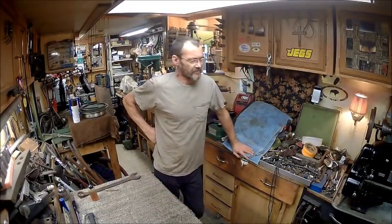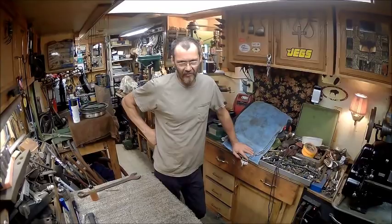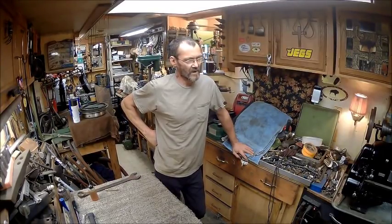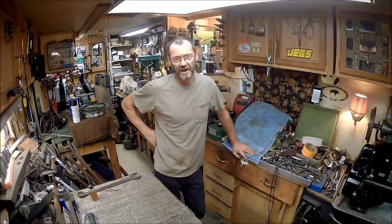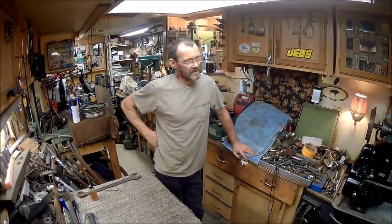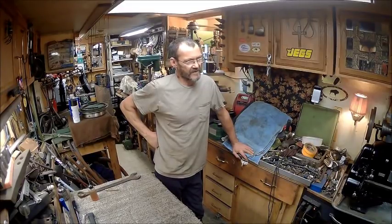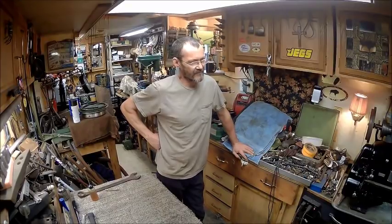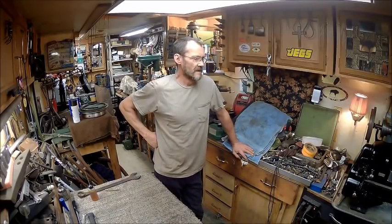It sucks though that it's only got a 3/4 inch through hole in the spindle. The Grizzly has a 1 inch. It's actually 1 inch and 1/32. So I like the fact that it's got a bigger bore in it on the Grizzly. They both have their downfalls.